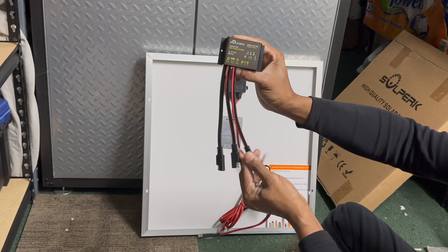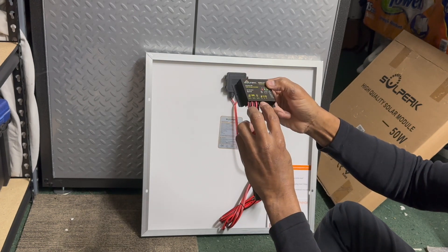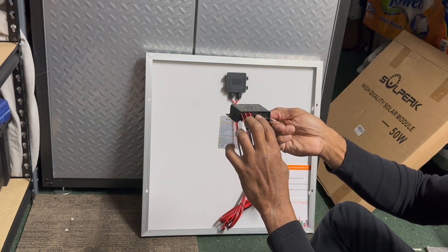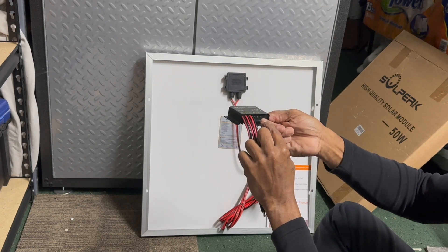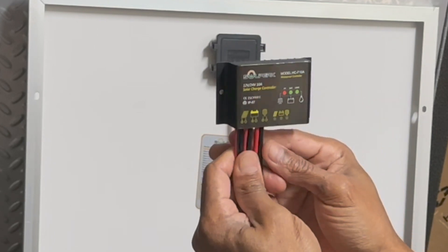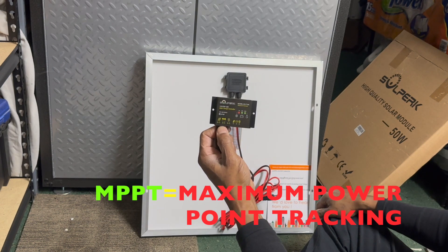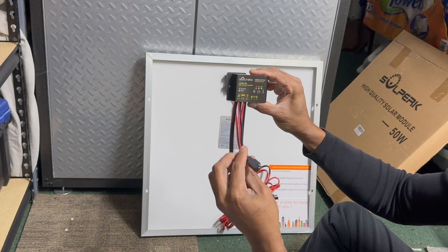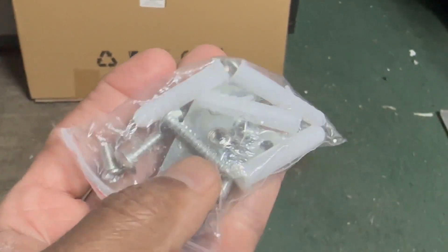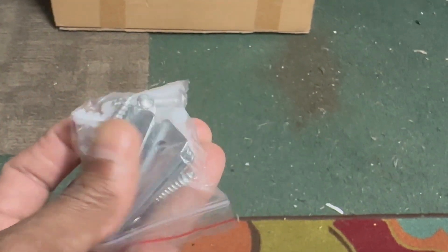They're all going to be fed off the battery and the solar input. You've got the three indicator lights — red, when lit, indicates the solar panel is coming in. The middle green light for the battery indicator means you're getting power from the battery through here. And the last green indicator light means you're getting power to run your 12-volt appliances. This is a 12-volt PWM charge controller, and I would prefer you to buy a much better charge controller, like an MPPT charge controller, so you can get better power handling. It also has mounting brackets so you can mount it on the wall, on the roof, or on top of a shed.